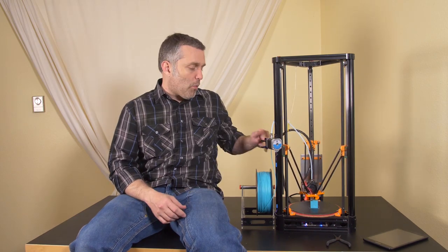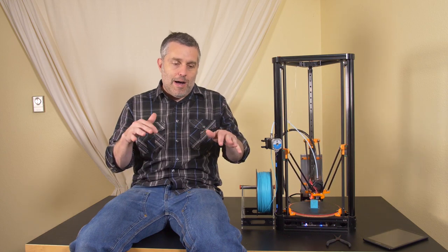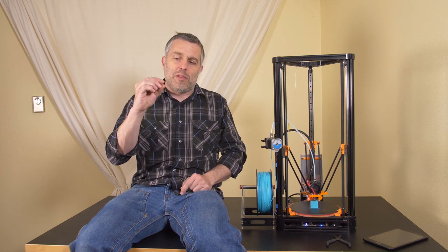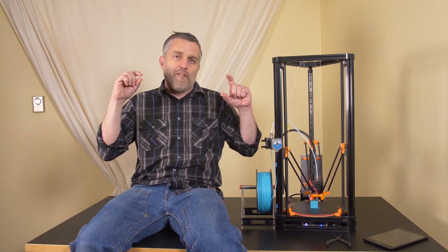And the reason I'm saying that is because even with the new control board that has that G32 functionality, the G-code command, it's still having the same problem that it had before, where it prints too close to the bed here on the edge closer to me and too far off the bed on the far edge. With Marlin, it was just way more extreme. With this one, I would say I'm about 0.1 millimeters too close here and 0.1 millimeters too far on the far side. So that's a total difference between the two of 0.2 millimeters. With Marlin, it was more like 0.52, gosh, almost 1 millimeter.